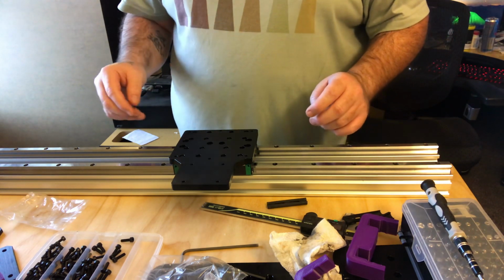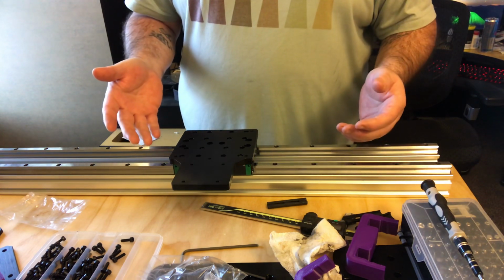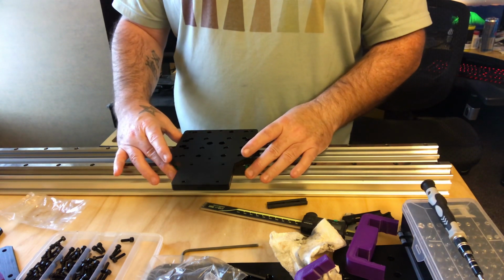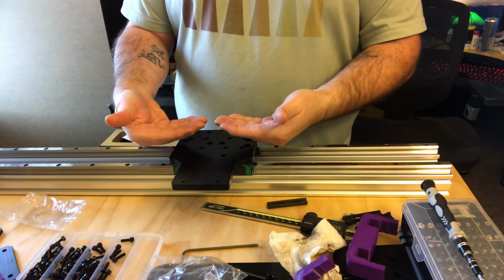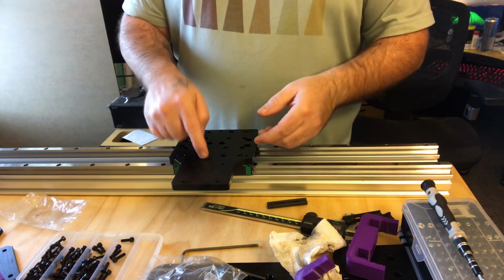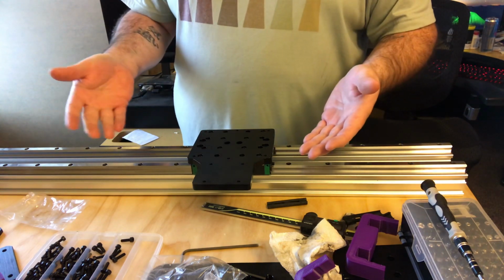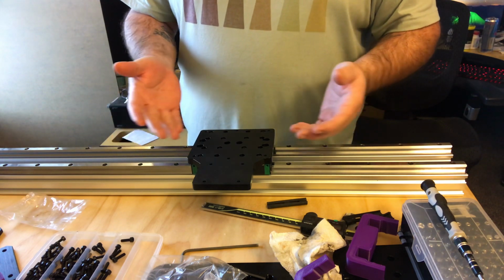So yeah, your plates, as they are right now, are stamped. They're not machined. They're trash. They're junk. They're bowed. And bolting a solid plate down to 4 separate pieces is not going to bring that plate straight. It's going to pull those bearings up to match this plate, and then you get this. This doesn't work. So stop trying to tell people that they're machined within tolerance. They're not. Send us something that works.